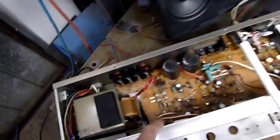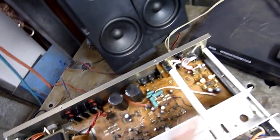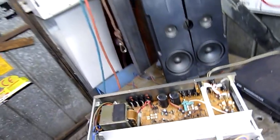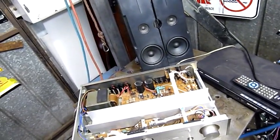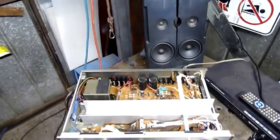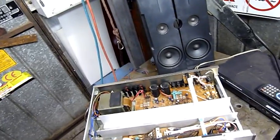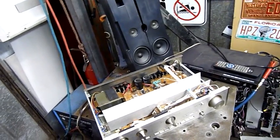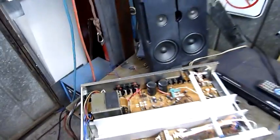The residue on the board was flux residue. It's the back half of the board, or part of the board up here, wasn't properly cleaned on the underside, and up here there was also a lot of flux residue. So the board itself wasn't properly washed at the factory, and that's what a lot of that residue was. So it's nothing nasty. It didn't get leaked on by anything at the scrap yard. It's just solder flux residue that was just a bit sticky. It's probably absorbed a bit of moisture or something, maybe, I don't know. There's no sign of corrosion or other issues, so it should not absorb moisture, I can tell you now. It was just sticky, so it's all good.